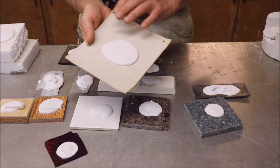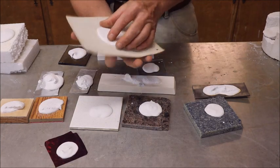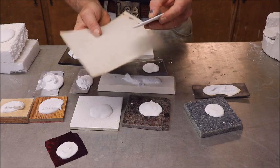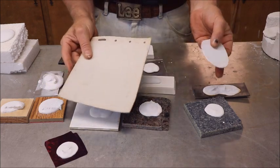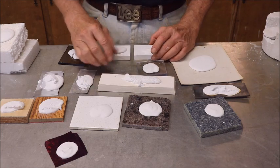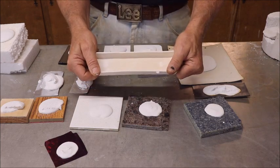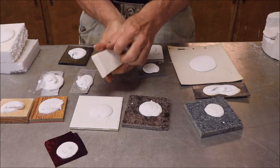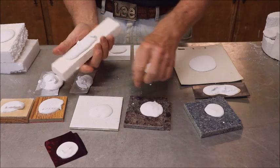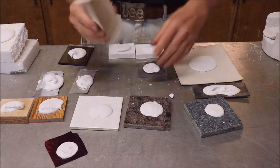Here's a piece of sandblast stencil, which is a rubber product — real flexible. It doesn't slide off, but it peels off. It stuck to that rubber pretty doggone good; if you had a mold coated with this, you probably wouldn't get it out. Last but not least is a piece of ceramic — just a little ceramic tray I make. I put a dab on there, and folks, that stuff is stuck to that ceramic. It's not coming off. So it sticks to plaster, and it sticks to ceramic.